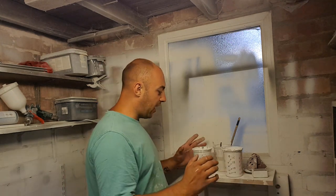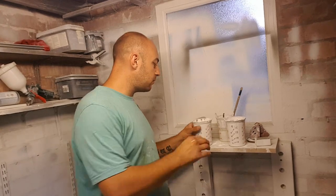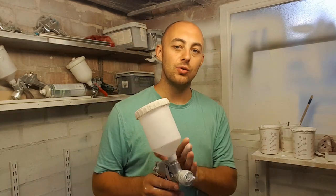I've got the neat paint in this cup — this is thick, very thick, so obviously it's going to need thinning down. I've put a 30-minute video out about spray painting techniques that goes over the paint and needle sizes. You thin your paint down according to the needle size you're using — whether it's a conventional spray gun or any spray gun with a needle setup — and the needle size corresponds to how thick or thin the paint needs to be.